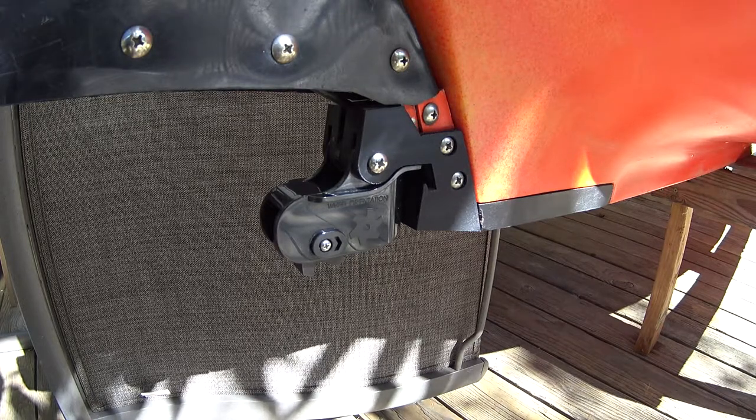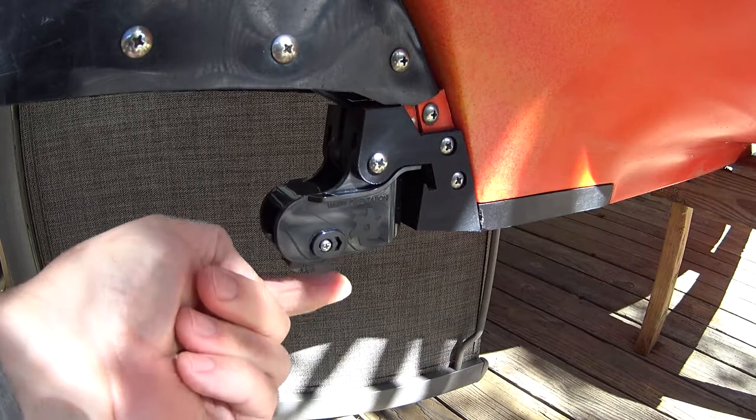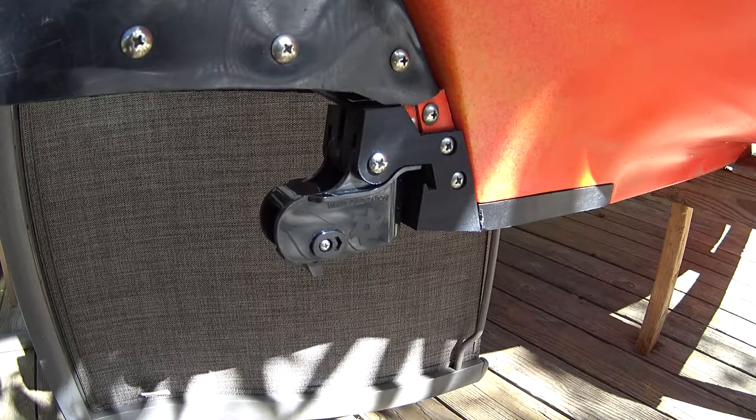I first tried powering it up with a 3.3 volt power supply and that worked, giving me a nice clean signal, so I didn't try anything beyond 3.3 volts. When it spins, it produces a square wave at a frequency of 5.6 hertz per knot, which is pretty much the standard for almost all the paddle wheel sensors I've seen, and this one corresponded to that standard.